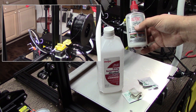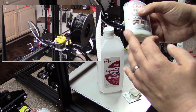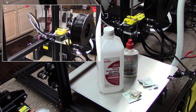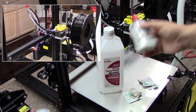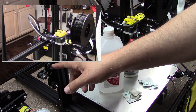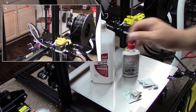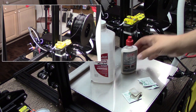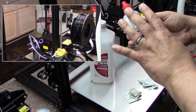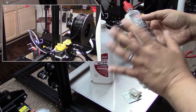What's really creating the film is the Teflon settling at the bottom. It does a nice job of making everything smooth. I use this on all my lead screws on my CNC machines and 3D printers. You can also use it on bearings — this stuff is like a miracle. It smells like a lighter fluid or some sort of cleaning compound, but the odor doesn't stay — it basically evaporates. So you want to have a little bit of ventilation when you do it, but it's not hugely bad.